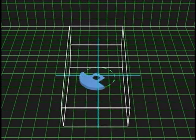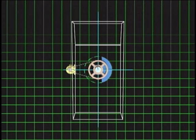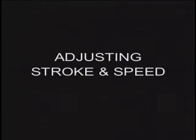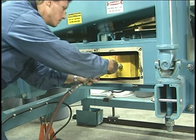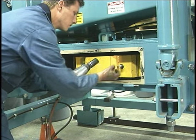Dynamic balance is achieved by placing the counterweight assembly as close as possible to the center of gravity of the screen's mass. The stroke can easily be adjusted in the field to permit fine tuning for maximum efficiency. Strokes can vary from 5/8 inch to 1½ inches in diameter.